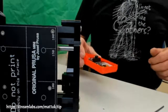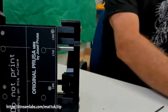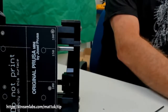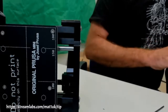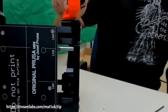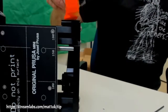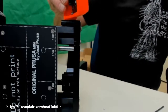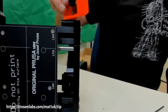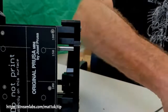Low torque wrench. Sounds like a plan. So, first, if you took the print, I've done that, yes. Press the LCD into the LCD holder. There is a notch that fits inside. So that's just going to sit on like that. Is that what you're telling me? Oh, I see. Use the M3x20 screw to connect both parts together. So M3x20.